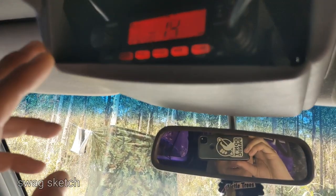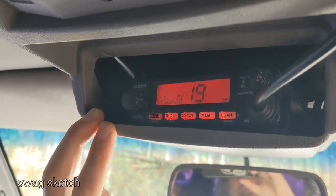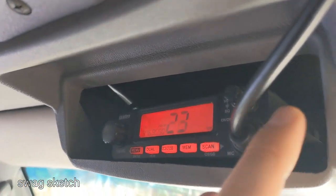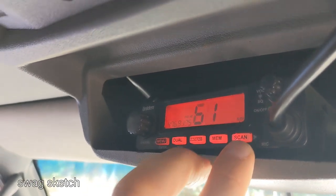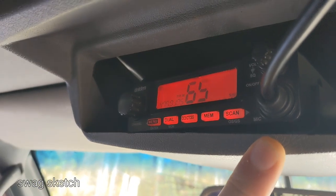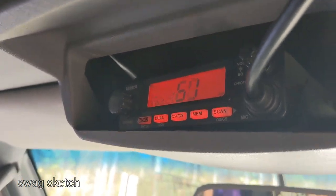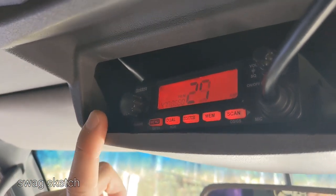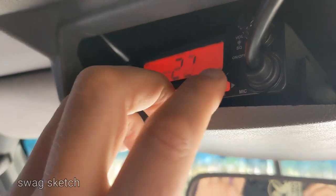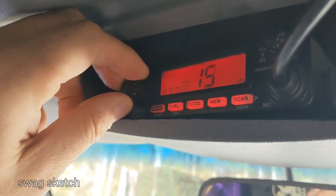This digital CB box I've got up here is a pretty typical one. It's not expensive, it's mid-range. You can pick up systems like this in any generic retail store. The main features that are useful are the band selector dial, volume control, and this scan feature, which is what's happening right now. It's in scan mode, so it just goes through every channel on the dial looking for any signal — anyone transmitting on any channel. If it finds a channel where someone's transmitting, it'll pause there and let you hear what people are talking about on that channel. If you click the scan button while it's scanning, it'll go back to the channel you set previously, and then you use the channel select knob to run through all the channels.